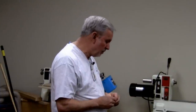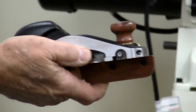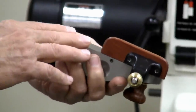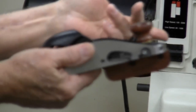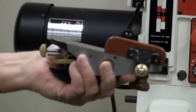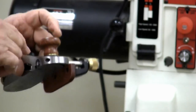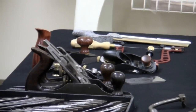So, the young man in the back, this is another one. So I've come to believe, and this will end this, bevel up, adjustable mouth. If it has those things, and it's well made, and almost all of the planes are well made today. They're well machined, they're heavy cast iron. The cast iron is cured. I won't even get into that. This, if you try it, will blow your mind. It's just a joy to use because it's adjustable mouth, has the Norris adjuster. It's just got everything. Those are Lie-Nielsons? Veritas. These are, yeah, Lee Valleys. Now, that's just my personal opinion.